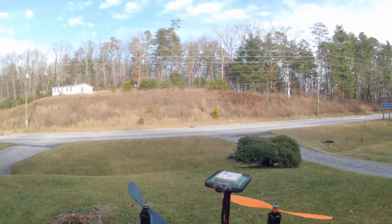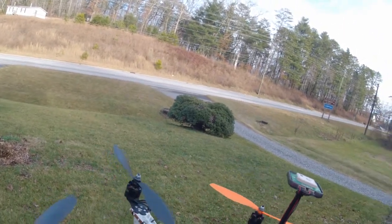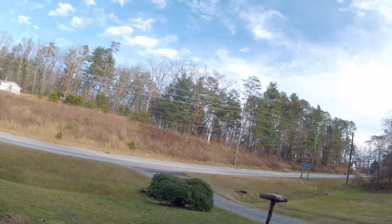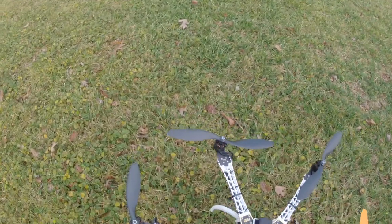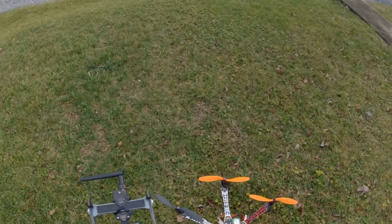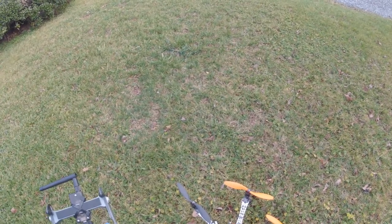Not exactly sure where. I use the autopilot for telemetry constantly, and also for backup. Also, in case something happens to the platform or to me, I can flip it into return to launch. I can tell it to loiter right there. It also fail safes automatically at a certain battery voltage, protects my batteries, and does an automatic return to launch. So the autopilot system is basically my buddy box, and without it working, I was not going to fly, so I did not fly the flame wheel at all.